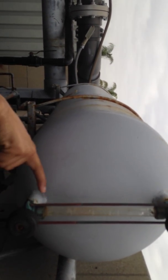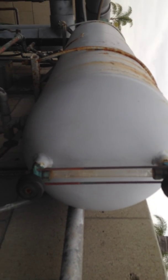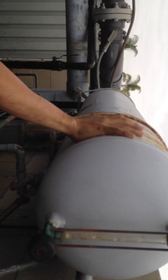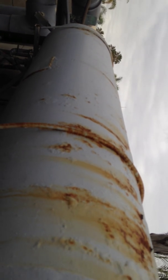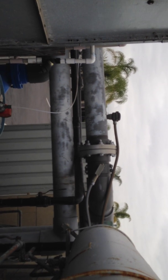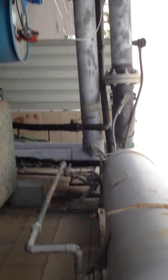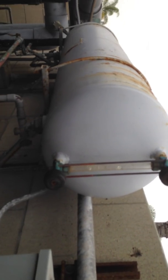When we open up the water we're going to recharge it. I want to get some bubbles and put them on these valves just to test where it's leaking from. There's a possibility that air could be seeping out of the actual body of this expansion tank due to rust — there are bubbles all over the place. It could also be a stem leak; the gaskets get worn. You noticed a stem leak right off the bat and tightened it up, but that's probably an ongoing issue.